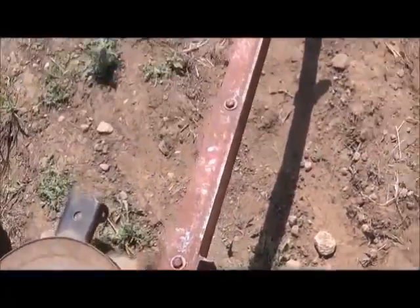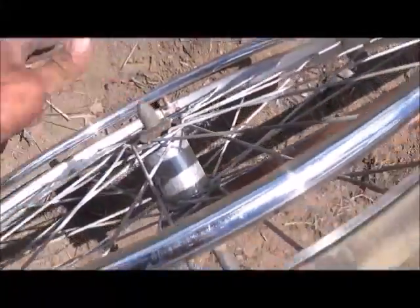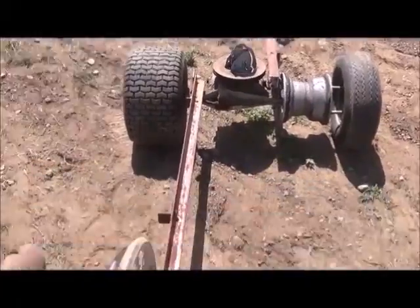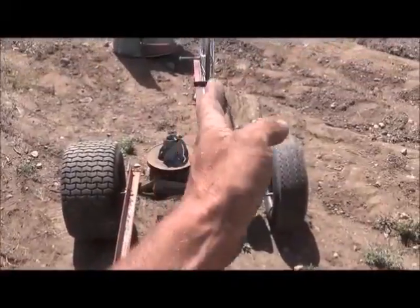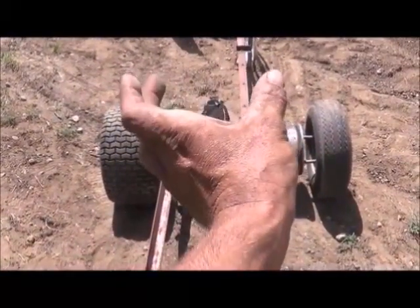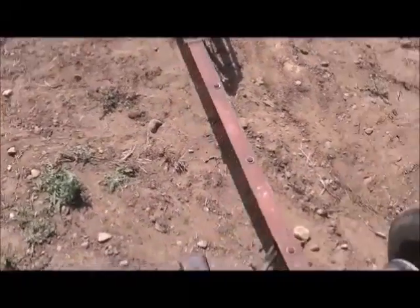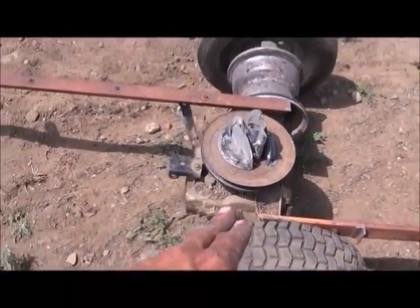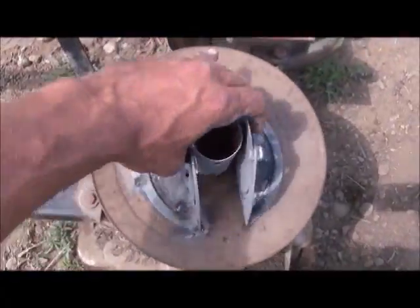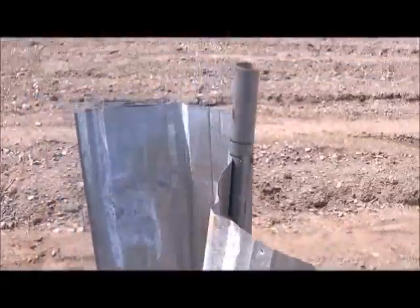On the other side, there's another piece of angle iron going off right there. At the end of it I have two wheelchair casters — a big bolt running through the center of the bearings — and they're just guide tires. One rod is on one side, the other rod on the other side, and that'll track those two tires on either side of a row, keeping the row right in the center. It's just really simple — angle iron mounted right off the original brackets, just a place to hold a piece of pipe right off the center.